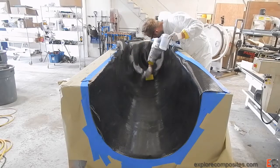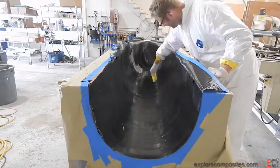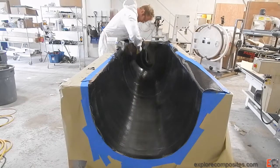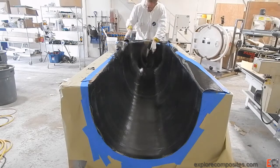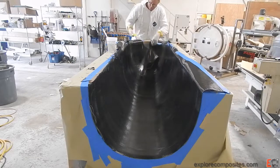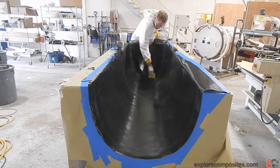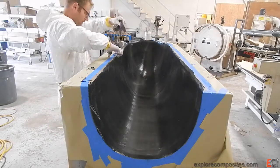It gets more complicated up in the nose part of the vehicle shell where you have compound curves, and after I get all the simple part tacked down, I'll work up there tailoring the nose so that it comes together sort of neatly. I ended up wrapping it around and making a joint on the center line. If this had been a clear finished part I would have been fussier about this, but we had just learned earlier that it was going to get painted, so the pressure was off in terms of making the carbon weave pretty. I just patched some pieces in, finished wetting out the inside skin, and made sure it was all well saturated before starting to fit the core.